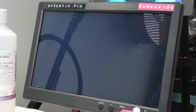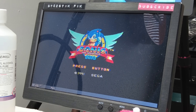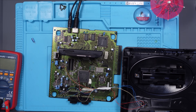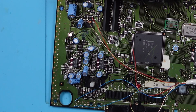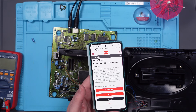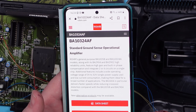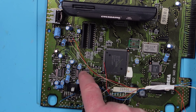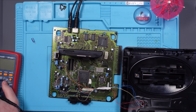9856 nanofarad, ESR 2 - so I don't think it's that. Let's try that. It's still got no sound, so I don't think it's those capacitors. Let's have a closer look at this board. Maybe I could swap that chip out for one on my donor board - there definitely are those chips on there. Let me just Google that chip - it's a BA10324AF, which is an amplifier basically. And there's two of those on there. They both go into this chip. Maybe one of these is 8-bit, one's 16-bit. I don't know - as usual, I'm just making it up as I go along.